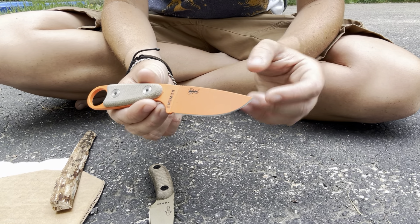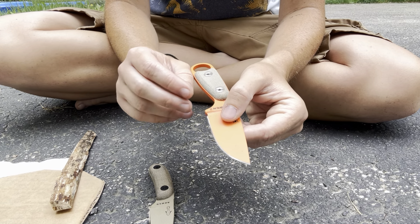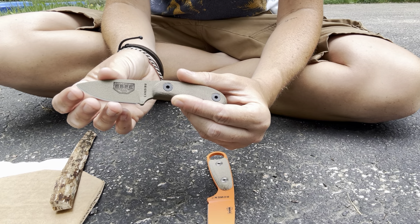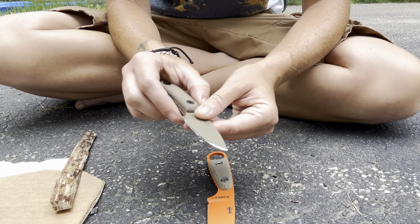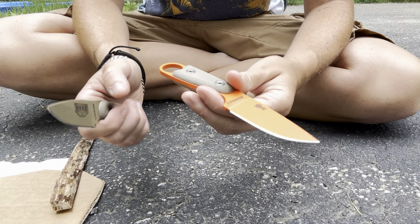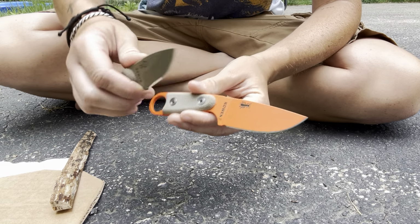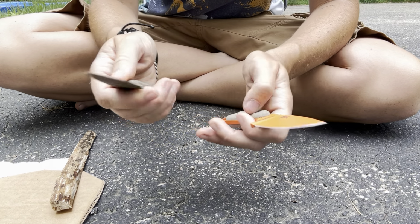I like that toothy edge that they take at a lower grit, but with a little bit of testing that I've been doing, this 1095 being at a high polish, the front end sharpness just feels so much more keen and crispy and bitey. So I'm actually wondering if 1095 is one of those steels that does better at a higher polish, because like I said, I'm always talking about steels that I like at a 600 grit DMT or even a 325 grit DMT, and I generally like that better. But I am wondering if 1095 is one that I will prefer at a high polish.